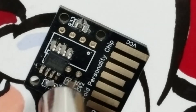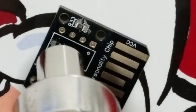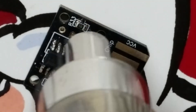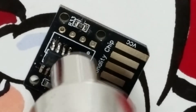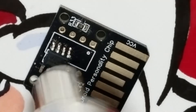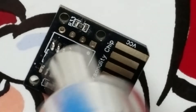Some things are starting to flow here. I think the first thing I'm noticing is I just don't have enough solder paste for the pins on the microcontroller and the flash chip. But hopefully you're seeing it — it goes from a dull gray to shiny, and it sort of congeals together.